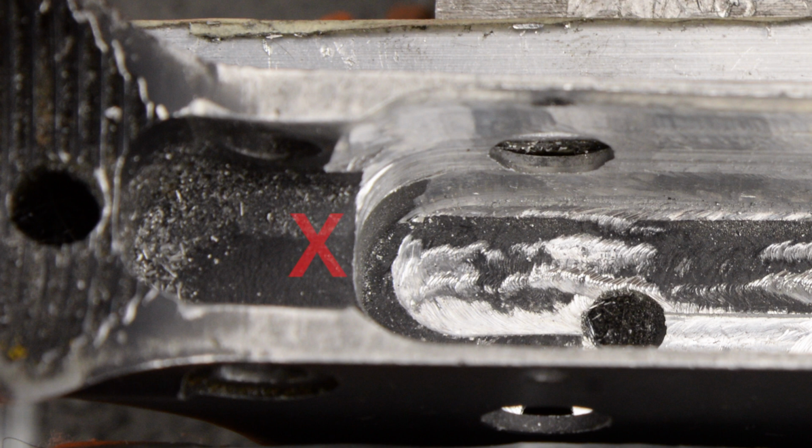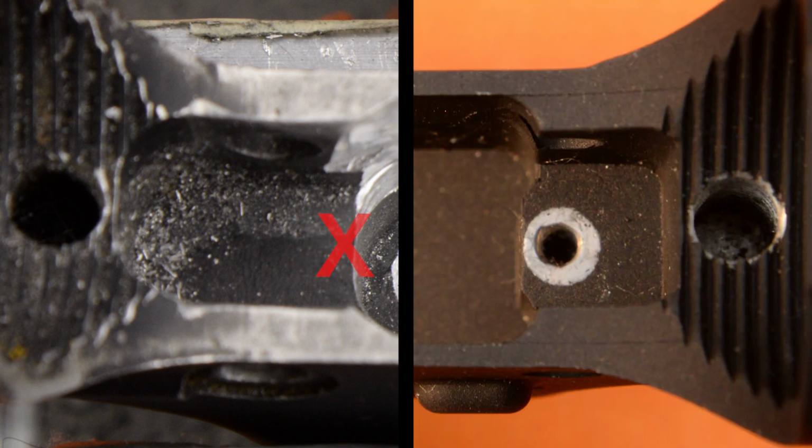Since I was stupid and guesstimated where the screw was located instead of drilling it out in the beginning. You can see here on the Airsoft lower that the wall should be just about 1.5 mm thick. It was a bad day to guesstimate. There's nothing to do but work with what I've got. And apparently I've got too little.